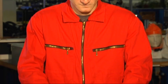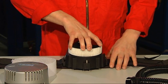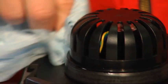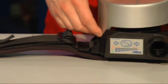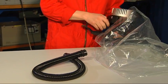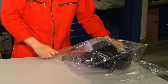To store the Draeger Explore 7300, first remove the filter. The particle filter can be reused; however, saturation should regularly be checked and saturated filters must be replaced. For further use, the filter must be stored airtight. Wipe any remaining dust or particles from the surface underneath the filter cover and seal the unit in a bag to protect it against dust. If all components are free from damage, the complete unit can be stored at 0°C to 40°C in a dry environment away from direct sunlight.